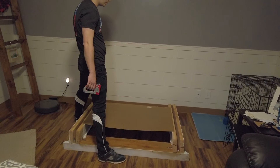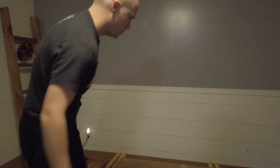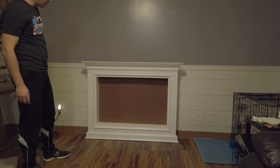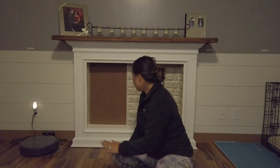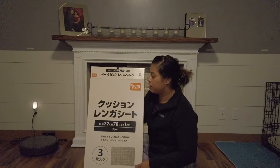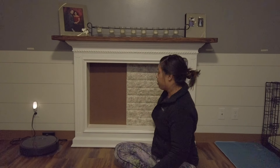We took the old backing from the mirror and stapled it onto the back of our new fireplace so we had a new backing and you couldn't see directly to the wall through the fireplace opening. Justin has the staple gun — let's see what it looks like standing up. Now we just have to put the mantle part on top and then brick the inside. We're screwing the mantle from the wall. We got this faux brick from the home store out here in Japan — came with three sheets and I think we only need two. They do stick, so I'm having to peel off the backing.